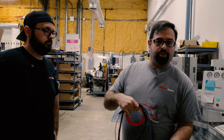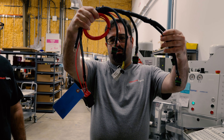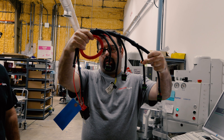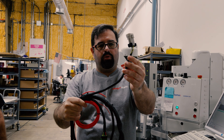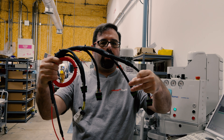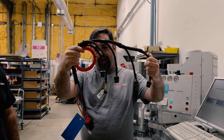If you make enough different types of wire come through the machine and assemble them together at the end, you get a wiring harness like this. This harness is for an ignition system on a GM LS engine — it plugs into the original LS wiring and allows you to adapt the IGN-1A race coils to your LS. This happens to be the driver side, but we make both driver's and passenger side harnesses for that application.